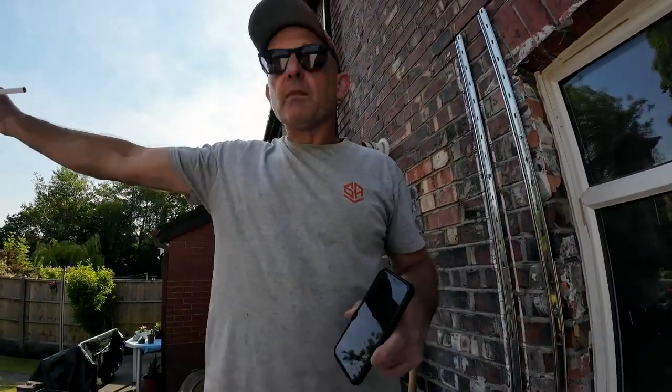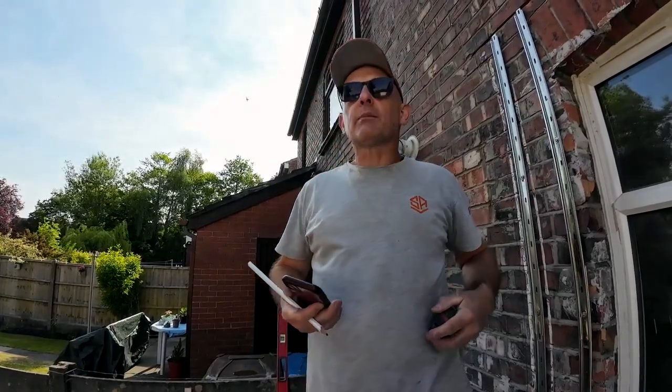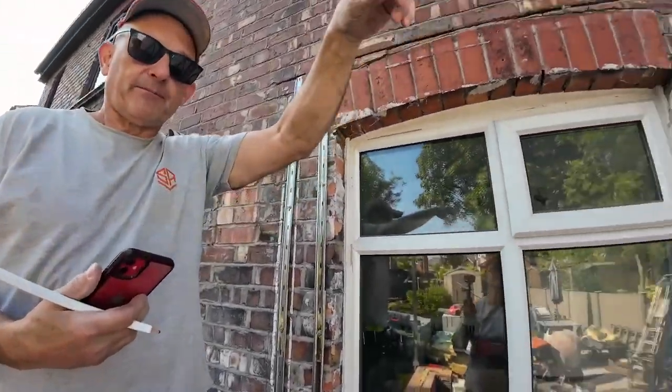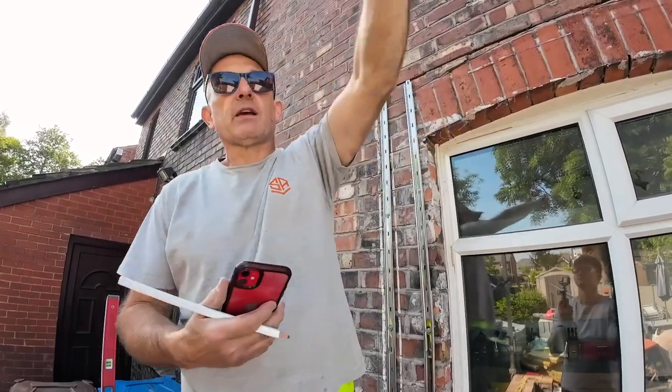And then I'll just swing the laser level around and put a mark on our profile. And that's it then. I think, yeah, profile's high enough. So what we're doing is we're levelling up to that before we put the steels in, because then we can put the steels on the wall. And then steels in, an extra four courses, and then some brickwork around on the front.